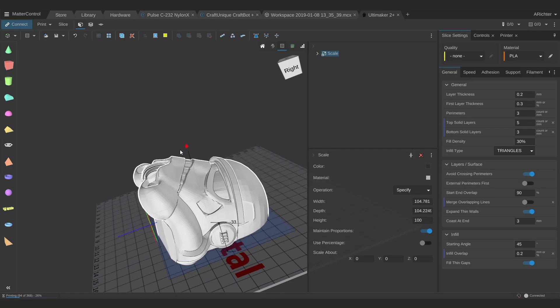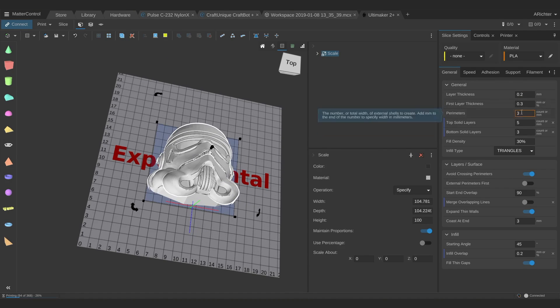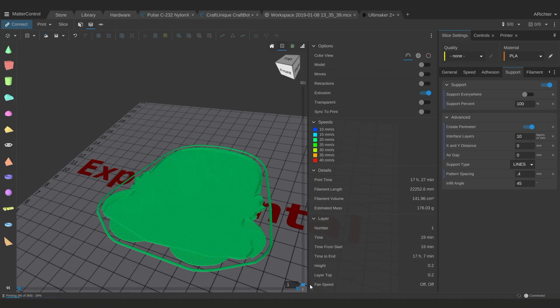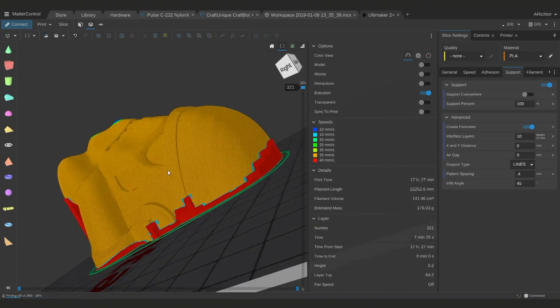In MatterControl, I dropped in the Stormtrooper model and put it into the bed so that I had a flat back for vacuum forming. But from there I still needed to change some support settings and other settings to get it to print better — like increasing the top solid layers to 10 from 5 to make sure I don't get any pillowing when I apply heat from the plastic. With the support settings, dropping everything to either 0 for distance or area, or 0.4 for pattern spacing since I have a 0.4 nozzle. This means the support is going to be 100% solid and will basically be part of the model, so I don't have any overhangs that would catch during vacuum forming. Now I have a totally vacuum-formable buck that will work just fine on the Formbox.